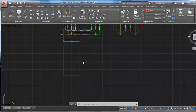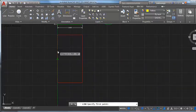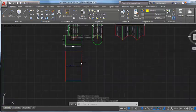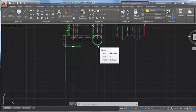I like to know the center line of this. We use yellow a lot for center lines. This line will have a midpoint in it, and I'll go ahead and snap in a center line on that. So I've just divided my pattern in half there. I could have this center line be, I could clock this thing any way I wanted, right? Like the center of my pattern could be at 9 o'clock or 3 o'clock, or at noon or at 6 o'clock. So I could pick any quadrant of the header to start my pattern.